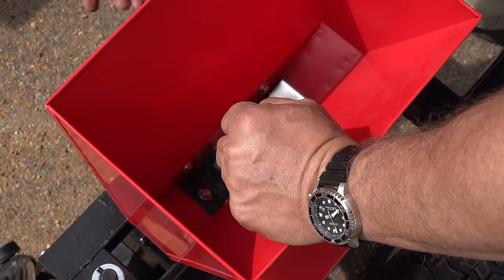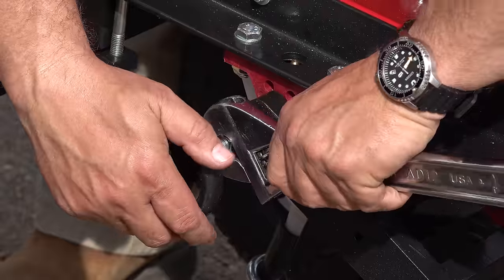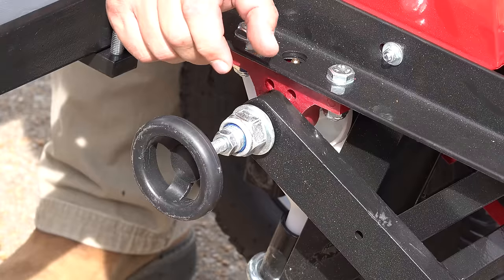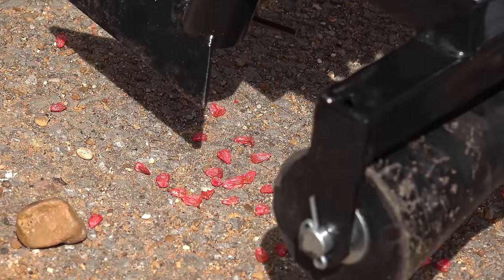The wheels are actually going to bury up in the soil a little bit and give us our one-inch drop - that's what I'm calling the 'fluff factor.' By adjusting this wheel on the side you can shrink the size of the seed hole. Right now it'll probably drop two seeds, so we're going to rotate this seed placer around to where it wants to sit so only one seed can get out. There will be cases where more than one gets out, but I'm okay with that. Once you get your seed placer to the right position, tighten this lock nut back down - if you don't, it'll expand while planting and start dropping two or three seeds at a time. Make sure you lock that back down.